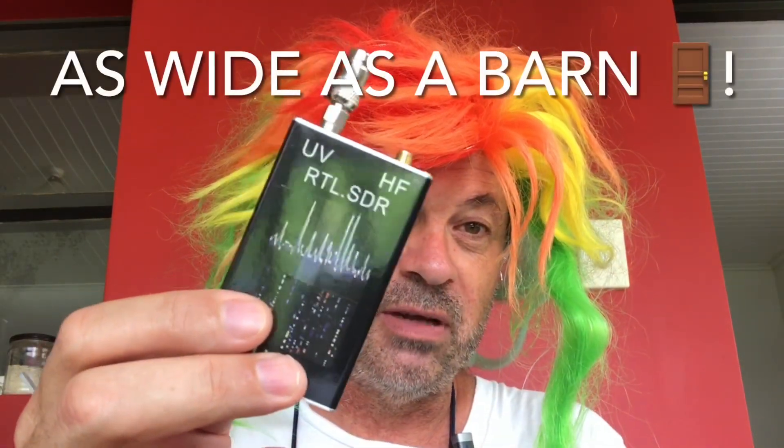The criticism of these dongles — this one was 50 or 60 bucks — is that the front end of the receiver is really poor. On HF, for the up-converter, they basically take an HF signal and up-convert it so that the dongle can receive it on the VHF/UHF part of the radio. But that part of the radio is poor. I've played around with settings, done a lot of research, connected it to an outdoor antenna — and even on AM broadcast it is woefully bad. Signal-to-noise ratio is terrible; local AM radio from Sydney is just so weak. I haven't managed to receive anything on the HF bands other than that very weak AM signal.